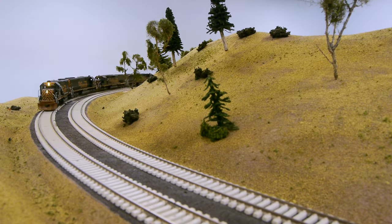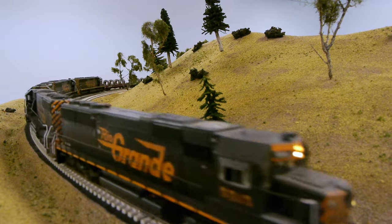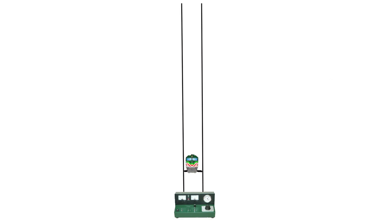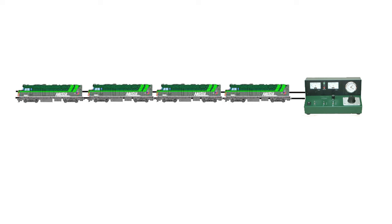It's Tuesday and we're still messing around with electrics. Last week we talked about parallel circuits and how when we put locomotives on the track they're going on in parallel. Even though it sort of seems like they're going on in series, each load across the tracks is parallel to the other one. For that reason the resistance is going down and the amperage flow is going up. Now let's talk about series — putting locomotives in series would really be a messed up thing requiring some weird wiring between them.